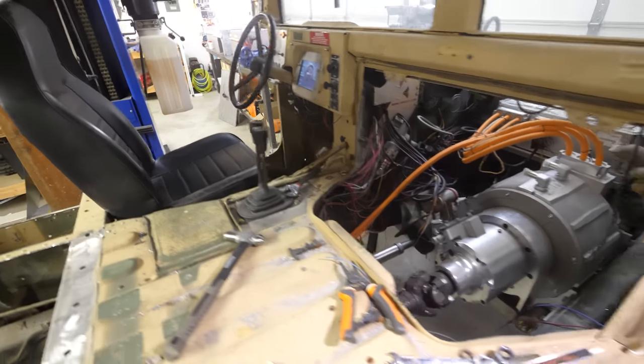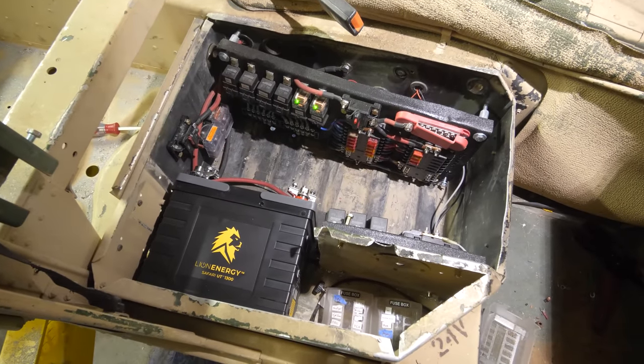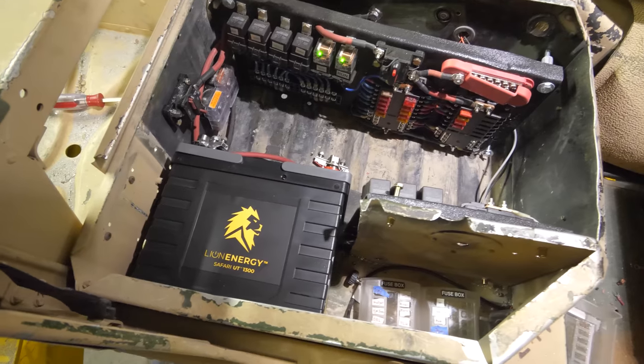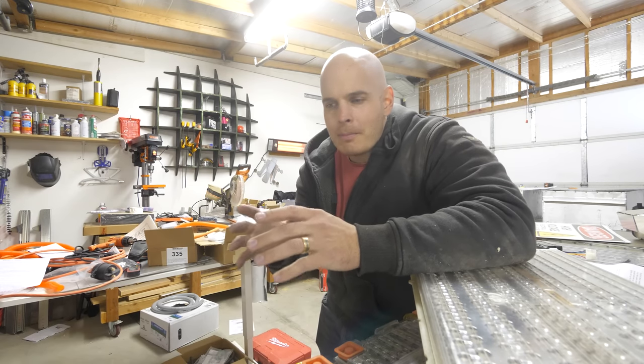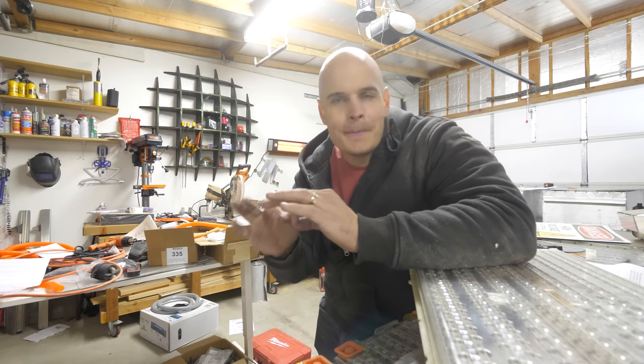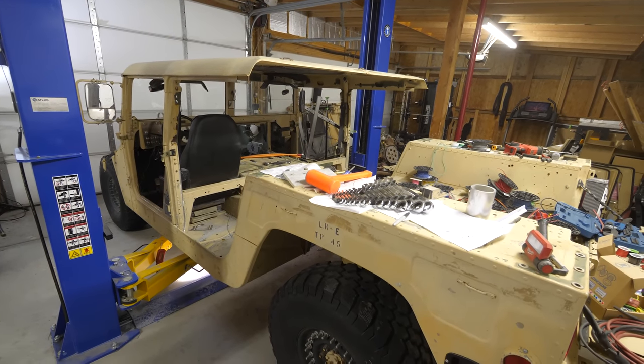And it's also why most electric vehicles, including Teslas, have switched to 12-volt lithium ion batteries for their low-voltage systems. I chose the larger Safari 1300 with 105 amp hours, but I do think they have some smaller ones as well. I'll leave a link in the description. And I know I'm talking a lot, but I'm hoping that my videos end up being the type of videos that I wish I would have had before starting this project.